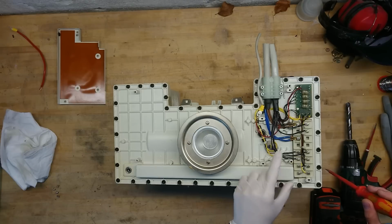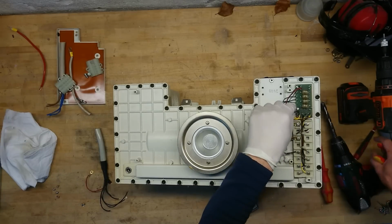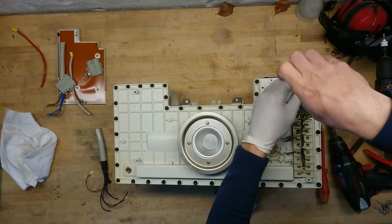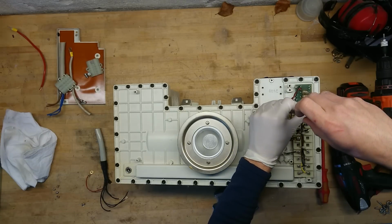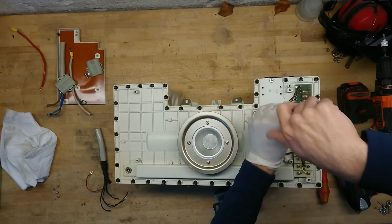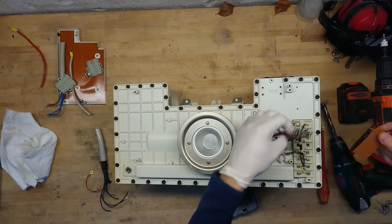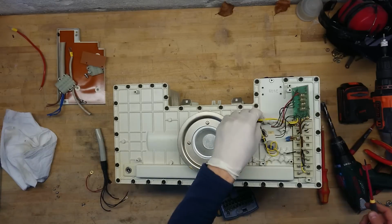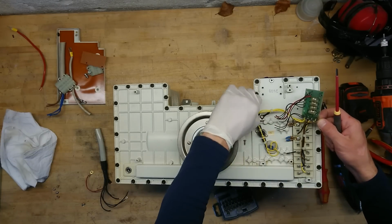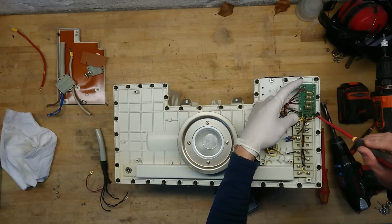Yeah, we'll just keep those in place unless they get in the way. I think it's safe to assume that this does not go anywhere inside the tank. But it's merely a safety precaution against high voltage into the control lines or measuring points. So it will short out to ground and trip the safety circuit. Certainly seems so. As we can see, all these spark gaps are connected up to the ground wire here.